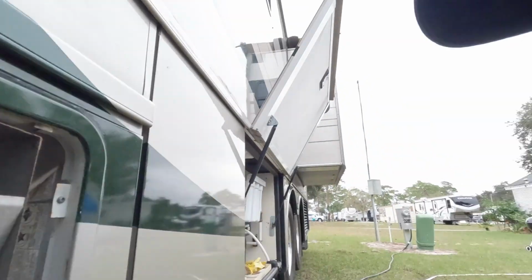So now originally they were asking me to replace the PNT valve as well because there was water coming out of it. But talking to them, the PNT valve is fine. It was just weeping because these tanks need an air bubble on the top, and I'm guessing at the last location they were at there was no air bubble, so when the hot water expands, it had nowhere to go, so it comes out of the PNT valve. Whereas now it has that air bubble, and so now the PNT valve, the pressure and temperature valve, is no longer weeping. So this is good to go.